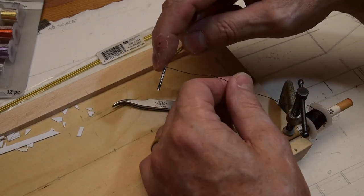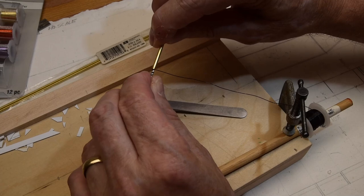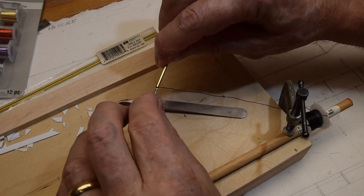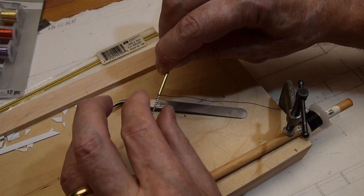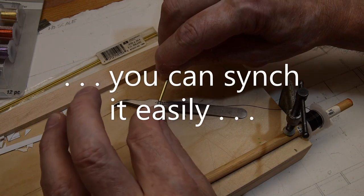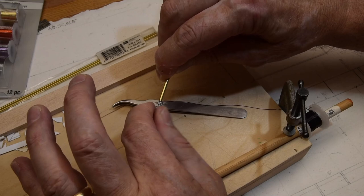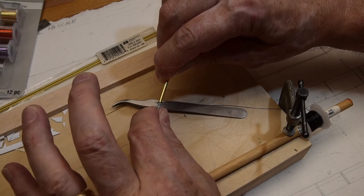Like that, just to add a little bit of tension, okay? Sometimes people want to wind it like that, it depends on you, how you want to set it up. And then I'm going to turn it with my left hand, and I'm just going to wind this wire as I'm pulling it out of the tube. I'm going to wind this wire all the way up this rod. And I'm not going to glue this now, because you don't have to glue it right away, since you're going to cut them to lengths, right? And then you might want to tighten up the coil a bit on each end to expose a little bit, if you had a threaded area or a nut going over, or an area to glue from, let's say.